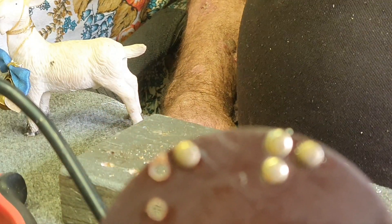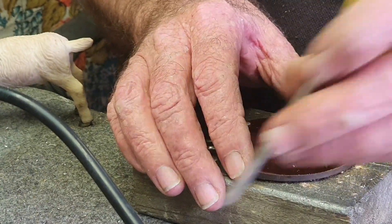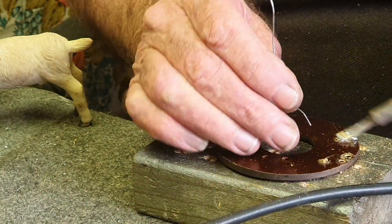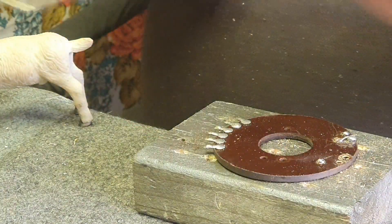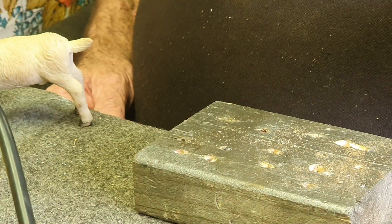Now what we're going to do is hammer them down. We're going to use the heel of the vise and pop that rivet in. We're using a punch to do this simply because, as I mentioned, they're not quite long enough. Now we're going to drop some solder on there to fix that up. We're applying a bit of flux to the back of the rivet. The soldering iron is heated up to temperature — about 420 degrees Celsius. Watch that flux burn up, drop the solder on, let it melt in — just a touch more — and bingo, it's done.